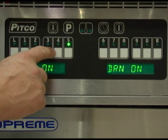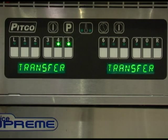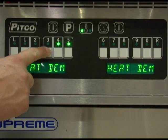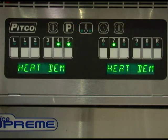Pressing product key number 4 will toggle the side on output on. The display will show side on or transfer, depending on whether you have the i12 controller or the i12 plus controller. Pressing and holding key number 3 will force the heat demand on output. The display should read heat demand and the heat light should illuminate. Releasing key number 3 will turn this output to the off state.